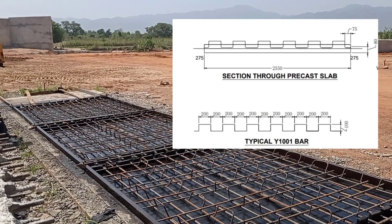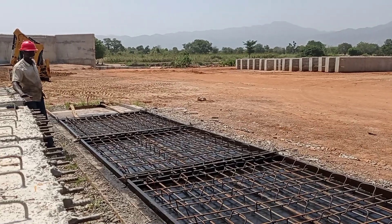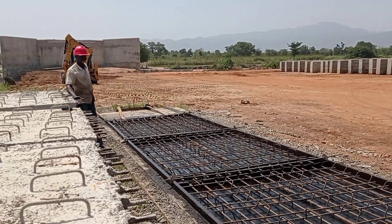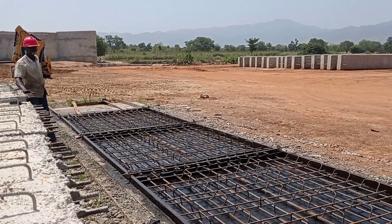You may see this cross-sectional design which we used. While placing the reinforcement bars, we also kept a space of 75 millimeters on top so that these reinforcement bars could be cast together with the help of in-situ concrete.